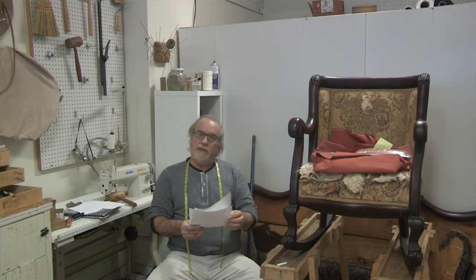If you're doing a club chair with eight-way tie coil springs and a big cushion, you want on the back cushion about 50% down and 50% feather mix — that seems to optimize the seating. It's all about comfort. Good questions, keep them coming. If anybody live has questions, please don't hesitate.